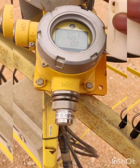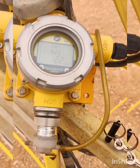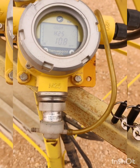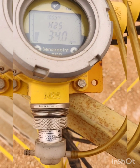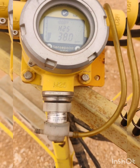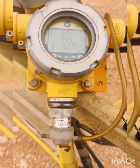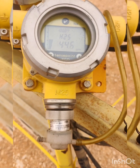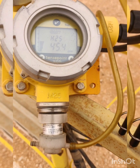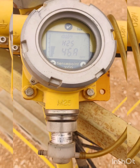In span mode, the full gas bottle symbol is shown. We remove the weather housing and apply the 50 ppm calibration gas. We can see the gas is being sensed by the sensor — it is rising and we need to wait until we get a stable reading at the 50 ppm maximum.